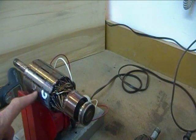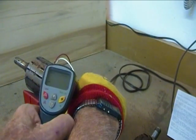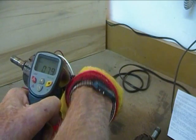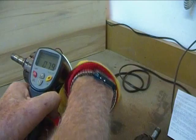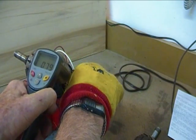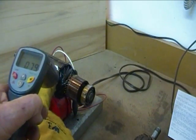You can see that this is armature C. Now a different armature is on the growler, and we'll see what happens with this one. You can see that there's really no heating at all going on in this good armature, which is letter D.